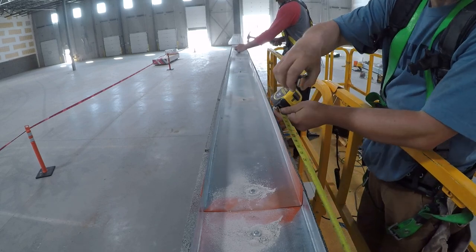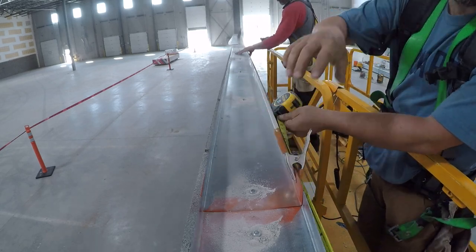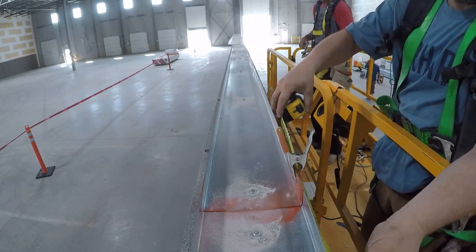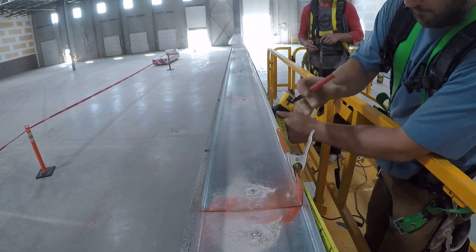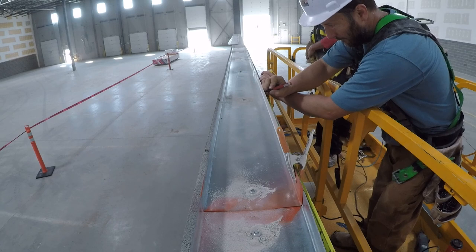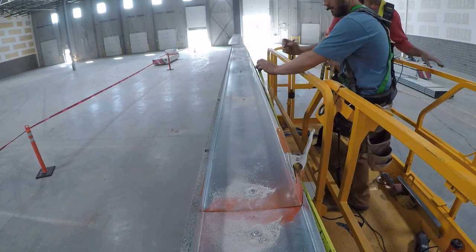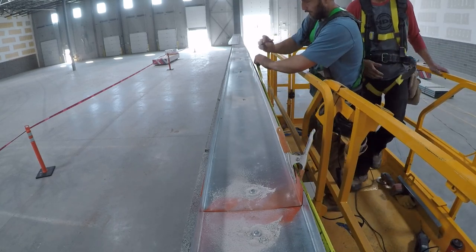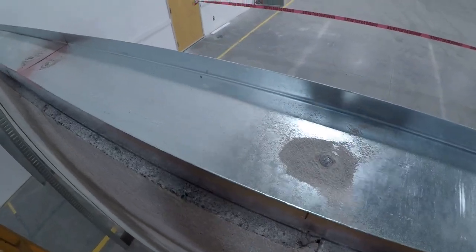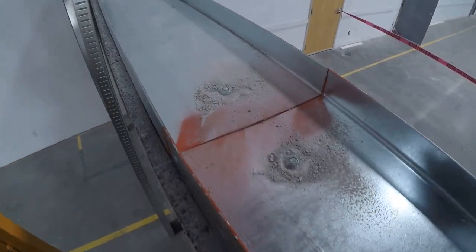The only difference is you might want to stagger your pin bolts and maybe add a couple more — stagger them from front to back of the track type thing. Do your layout every time you lay a track. Your efficiency has to start with your lift placement — you want to do all the work you possibly can in that area before you move.